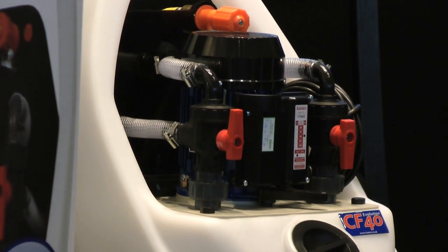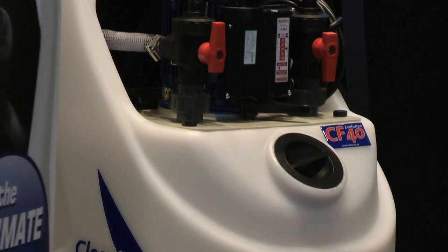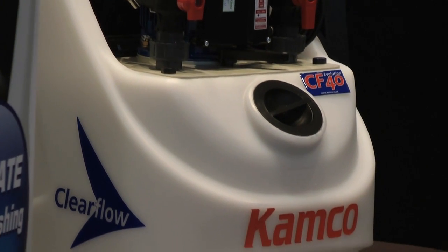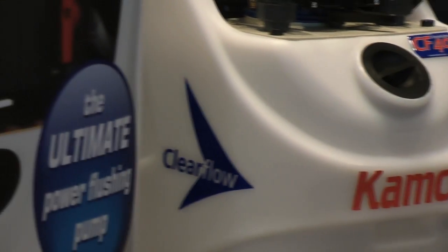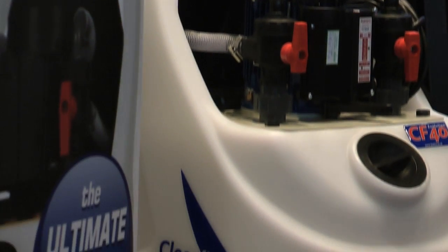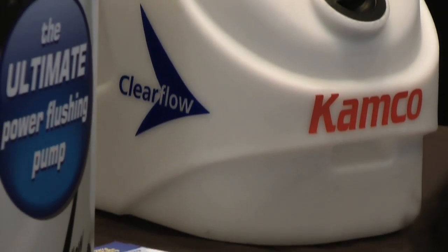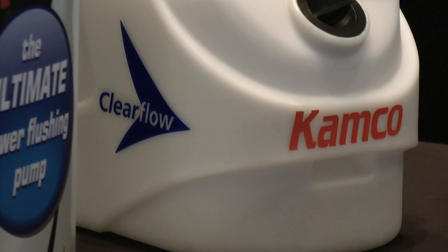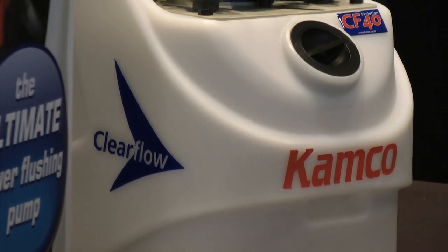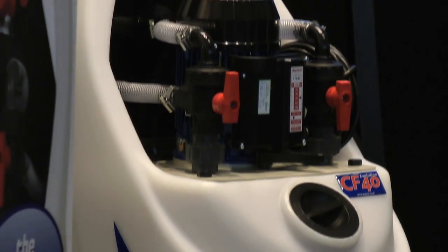and then you will start dumping on that radiator alone. Just the one radiator. Again, you're doing that so you've got the highest flow rate you can on that one radiator. So you're going to start working your way back around the house in the opposite direction. So you'll dump on, say, radiator 7 till you get clear water out the end of your hose. Then 6, then 5, until you've done them all. And eventually, of course, if you keep doing that, what you effectively have is a system with fresh, clear water, which is what you were after. Okay?